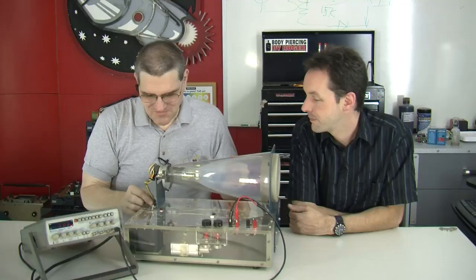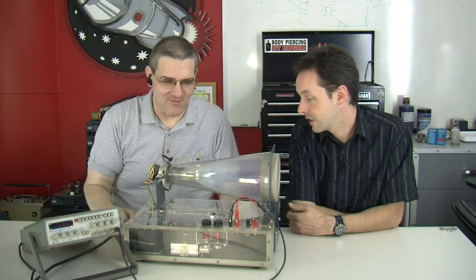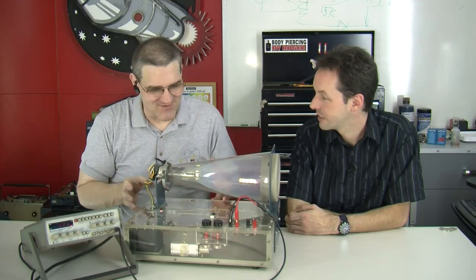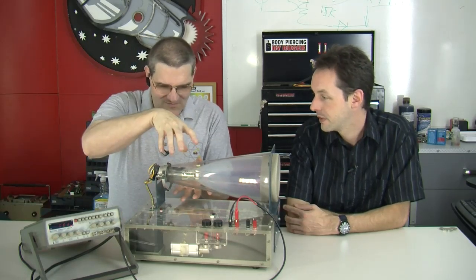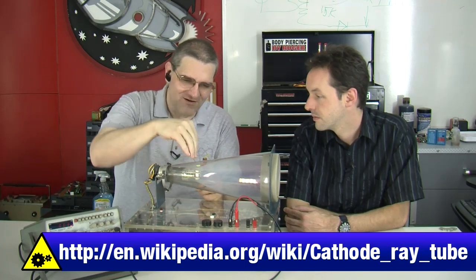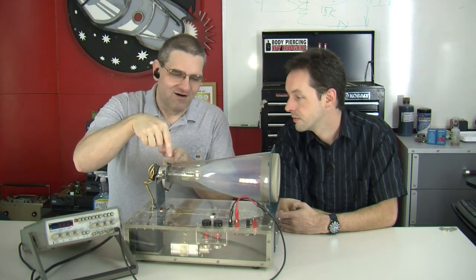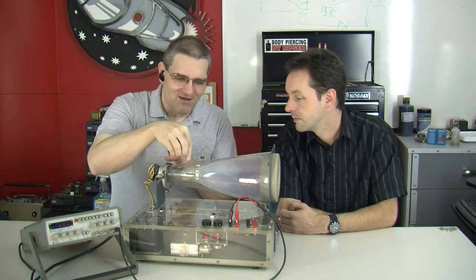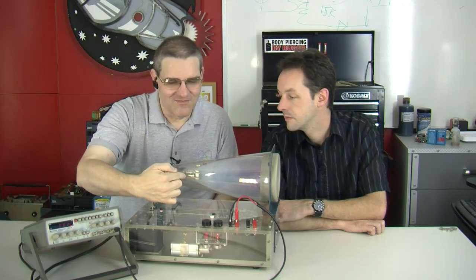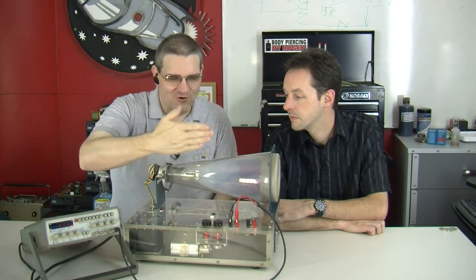You were calling this geek porn – this would be the peep show, because everything's exposed. You can see the whole inner workings of an oscilloscope here. This is the simplest oscilloscope – you aren't doing measurements, this is more just for demonstrating what's going on. The whole center is the electron gun in the back, and there are vertical and horizontal deflector plates.